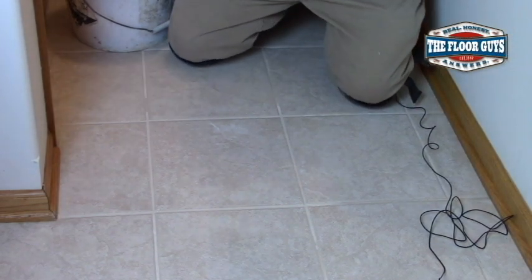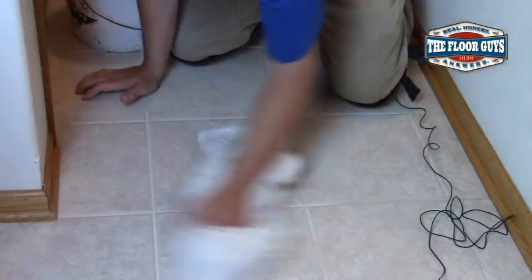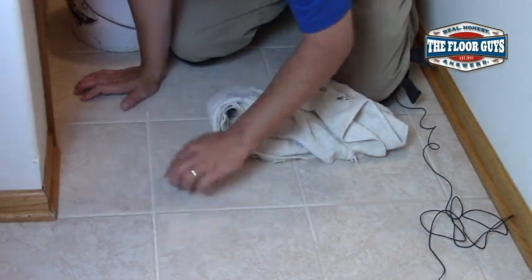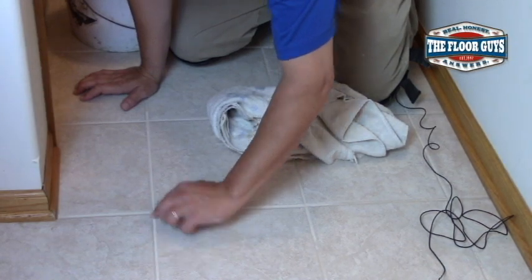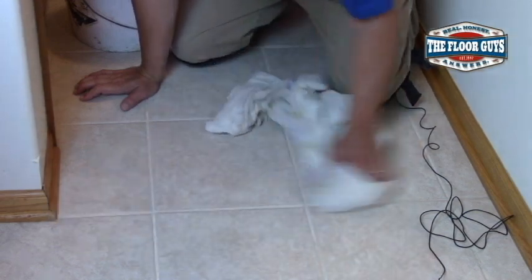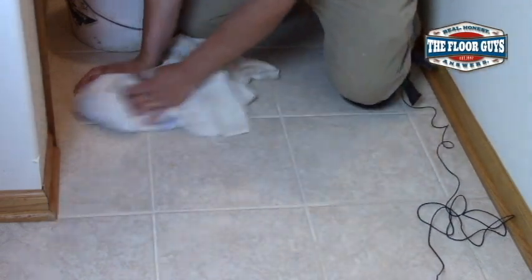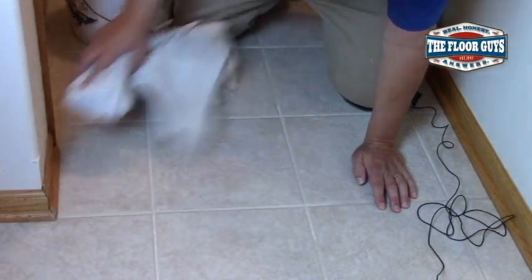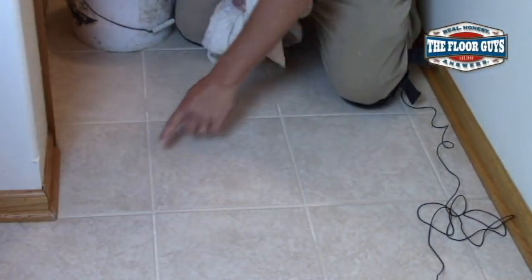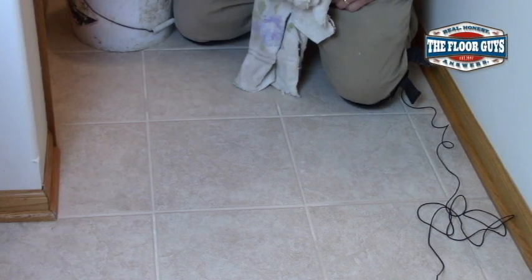Simple as that. Go back over it with a dry towel. If some of the grout is a little high or you don't like the way it looks, you can take that wet towel and smooth it out because it hasn't cured yet. You can even take a dry towel to make them look right. Repair that — no time at all. Took about 5 to 10 minutes of total work and about a half hour of dry time. Good to go.